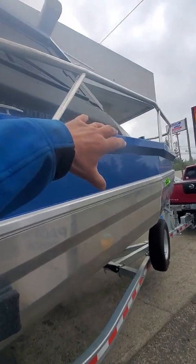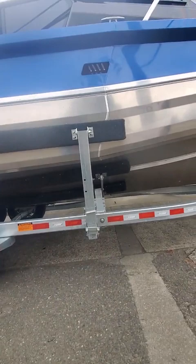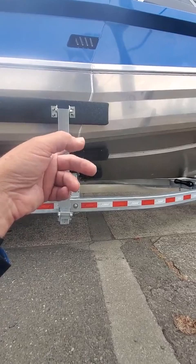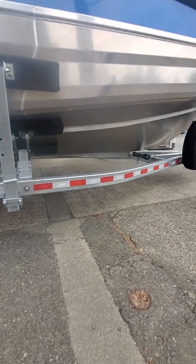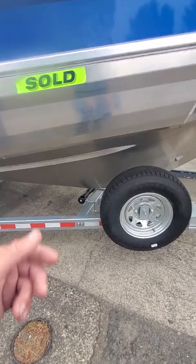If you get a lot of water, you take some over the top, it comes in here and drains out instead of going into your deck. G2, G3 tubing — kind of curves under with those reverses. When it's coming down it creates an air pocket and helps slow the boat down instead of banging you. You got lifting strakes — helps keep the boat lifted quicker. Between that and this, she'll corner on a dime. Keel roller — you don't use that to rest the boat on; that's just the crossmember so it doesn't hit if you happen to not put enough boat into the water.